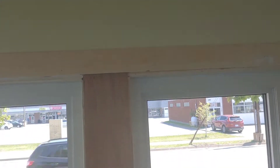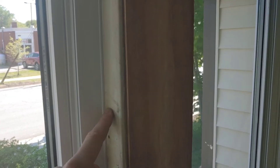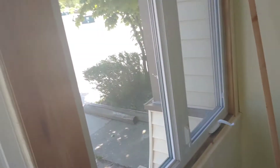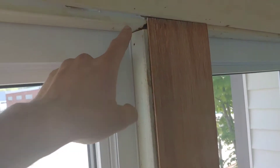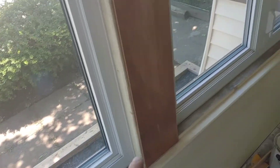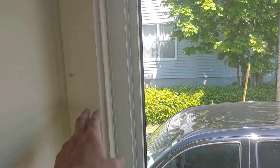It doesn't look like much now, but I'm going to come back and caulk all the seams, then prime and paint everything in white around the windows. Around the windows I used this piece I call a quarter round shoe mold — it's more of a rectangular shape — left over from the kitchen, and I had just enough to fill in all the openings. So all the windows are trimmed out. I just need to fill the knot holes, sand, caulk, fill, sand again, then prime and paint in white. I think once all this white trim is in, the crisp whiteness is going to look really good.